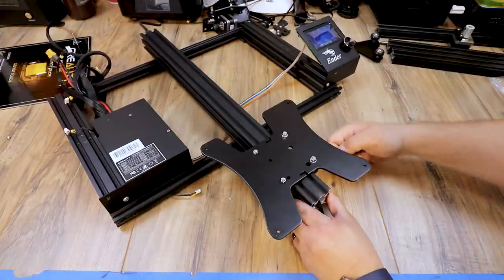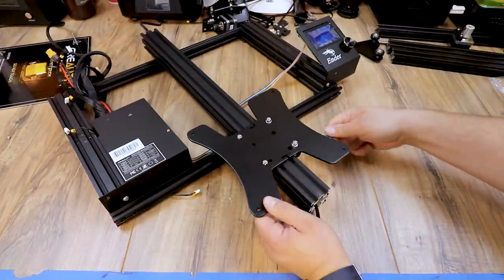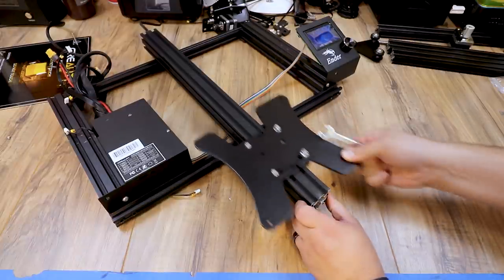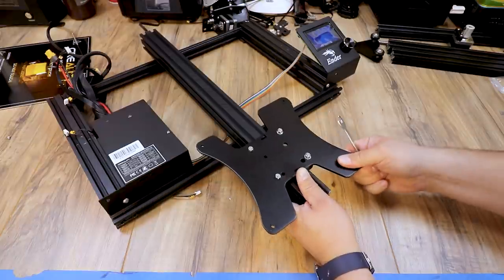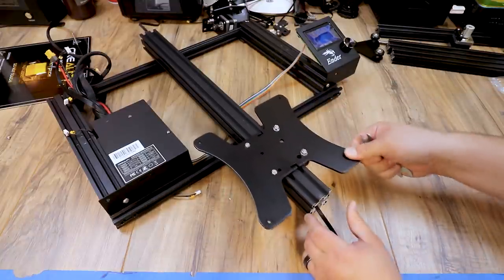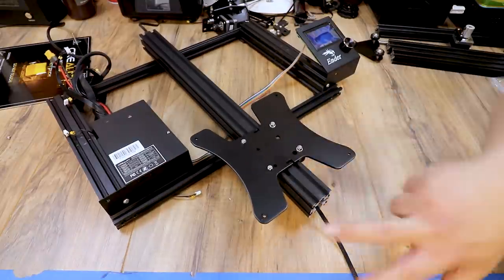Mine is super tight, so this is the perfect time to adjust the carriage. Loosen it up until you get a visible wobble on both wheels. Once it's wobbly and super floppy, come to the front and start tightening just a little bit — just enough to make the wobble go away, but no more than that and no less than that. Go back and forth between the front and the back until there's no wobble at all but this thing rolls super smooth. You want to do this now so you don't have to adjust it later when everything's built on top.